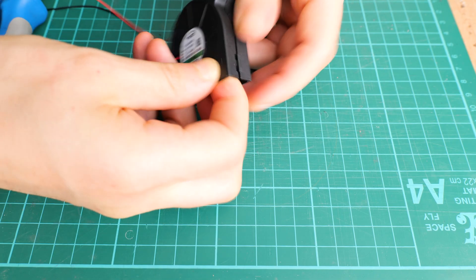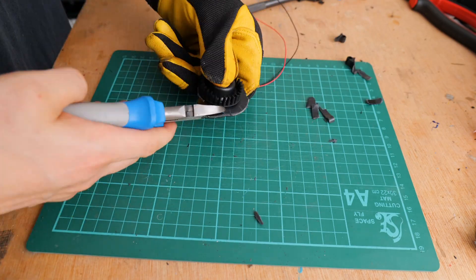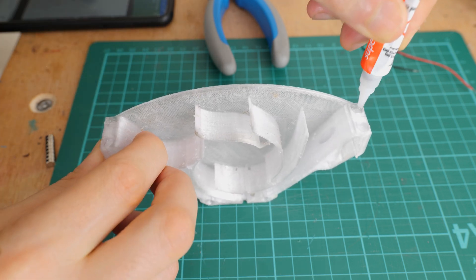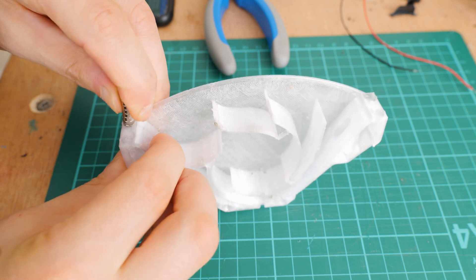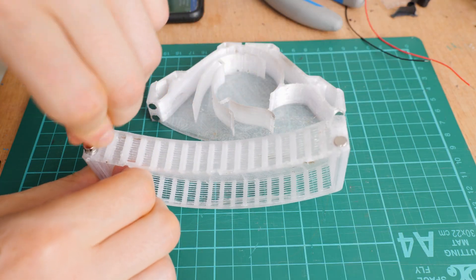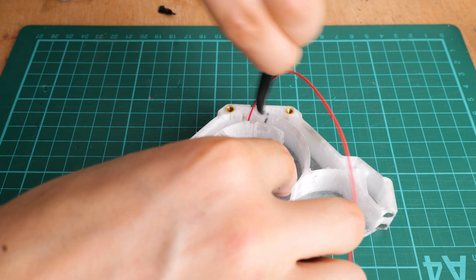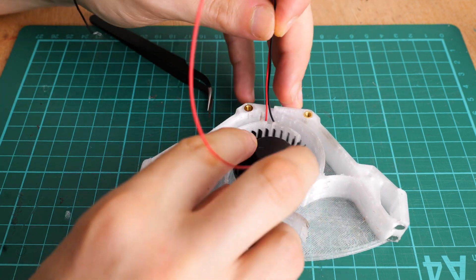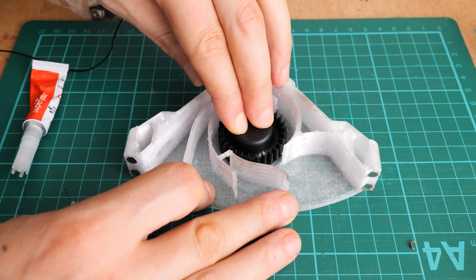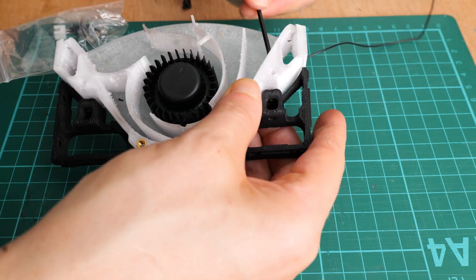To assemble, first take apart the blower fan by prying it open and using plier cutters to chop off the plastic casing, leaving just the fan. The bottom casing should be roughly the same diameter as the fan. Push the magnets into the holes - I'm using 6x3 magnets - and add a dab of super glue in each hole to keep them in place. I use the magnet stack to push each one in, then slide it off to prevent pulling the previous magnet out. Next, install the threaded inserts, then install the fan through the small wire hole and glue it onto the Nevermore case, making sure the fan rotates freely. Then fit the mounting brackets and install the lid.